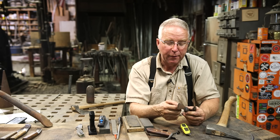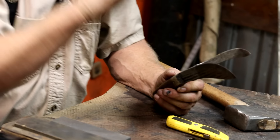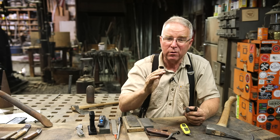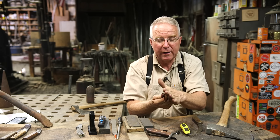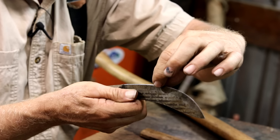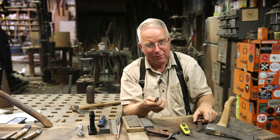When a knife gets dull, the very vanishing zero edge is worn back or bent back or turned into a thicker edge. The only way to re-establish that knife edge is to remove material, to grind material back the same amount on both sides until the zero edge, the knife edge, is re-established. What that means is that you are making your knife smaller using some method.